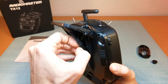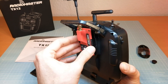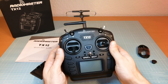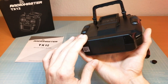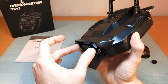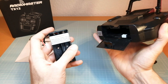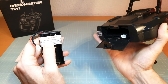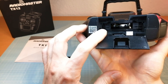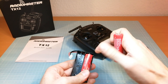That definitely makes the Radiomaster TX12, in addition to the multi-protocol module and the OpenTX firmware, a full-featured and future-proof transmitter in my opinion. On the bottom there is the battery bay, where we can use two 3.7V Li-ion 18650 batteries in the battery case or a 7.4V LiPo battery. We also find the SD card slot inside the battery bay, where we can add a microSD card to add the OpenTX SD card content to the Radiomaster TX12.